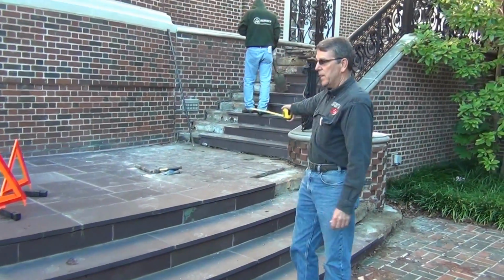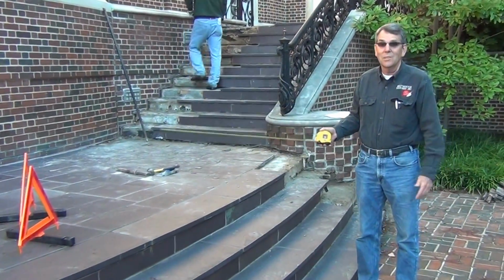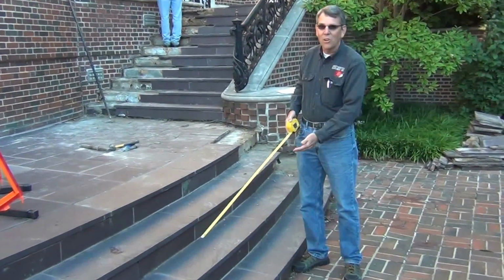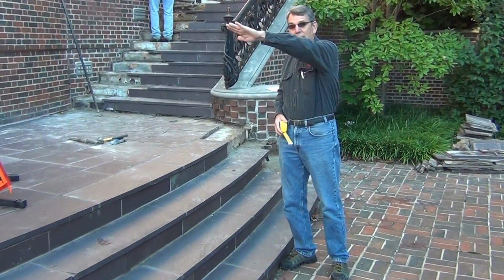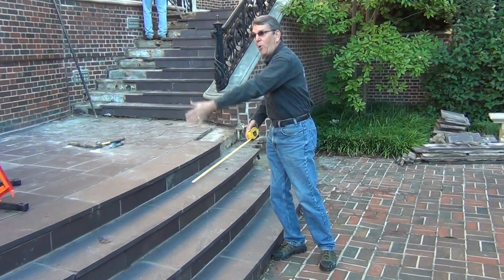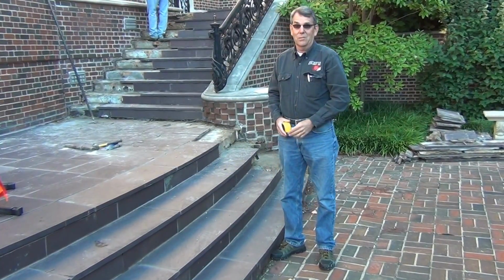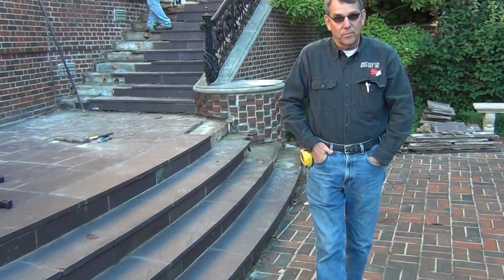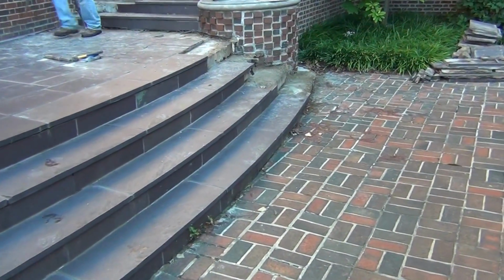You've got these steps and then you've got these steps. If they have to all be the same, which is possible, then no, you couldn't eliminate the step and make these taller. In a stairway, they all have to be the same. I don't know if this would be part of this stairway in their mind, or if this would be separate. That would be city codes. We should talk to codes perhaps, before we get too far, before we finalize the design. Know for sure what we're doing there.